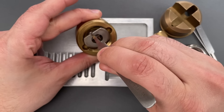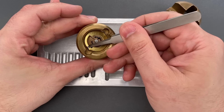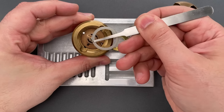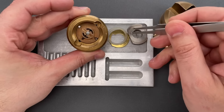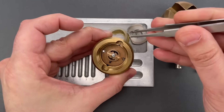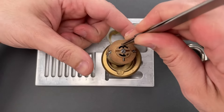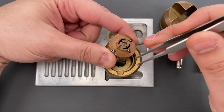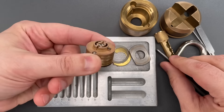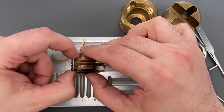That is the locking lug — by turning it, that will secure the shackle in place. There's a brass ring that limits the movement of the core to 90 degrees. There is a nylon washer, probably to provide a little bit of lubrication, and you can see there are two sidebars, one on each side. I'm going to pull this out, and unfortunately it doesn't really stay together very well. I'm going to hold all the parts in place, but there's no such thing as an organized disassembly here — once I let go of these, parts are just going to start dropping out, and there we go.